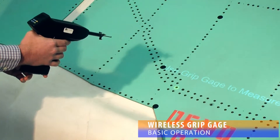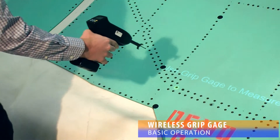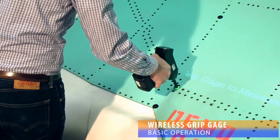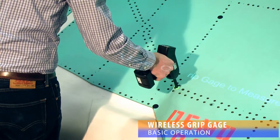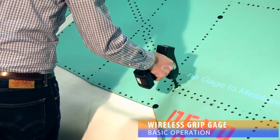The gauge simply needs to have the trigger swept across its full range to be calibrated. Measurements are performed by inserting the probe tip into an opening in the surface, orienting the gauge so all three tips are in contact with the part, positioning the gauge so the hooked tip will catch the inner surface of the part, and squeezing the trigger. This action sends the measurement to the computer.